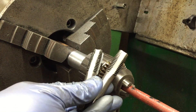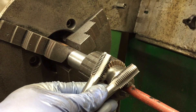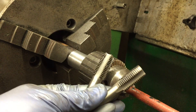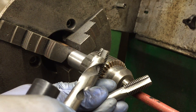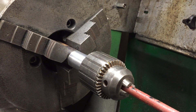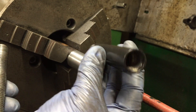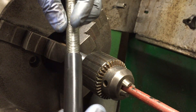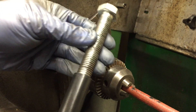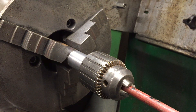So then I've got my cheap Chinese starter and medium tap. I haven't got the finishing tap — that's not a finish with a slight taper, so that must be first cut, second cut. I haven't got the third. When I've got all that done we should be able to adapt to the mixer machine, which this is apparently the adapter for. That's M16 — maybe it was 14 but once I get to 16 mil I think that's the right size. That's a standard thread and then we can go somewhere.